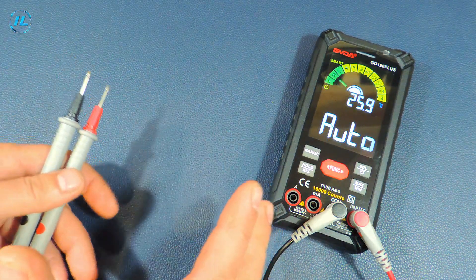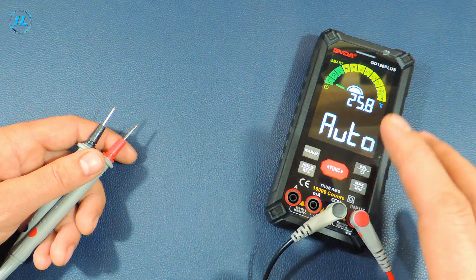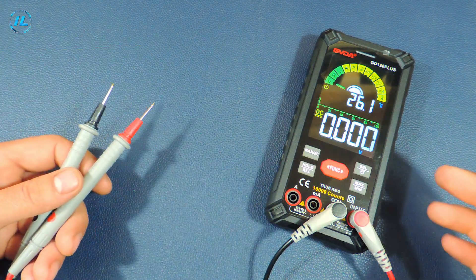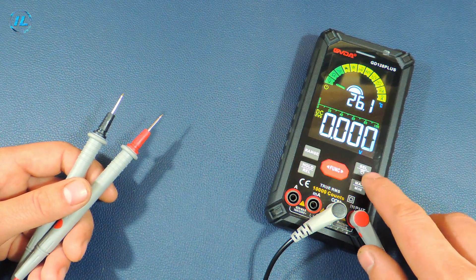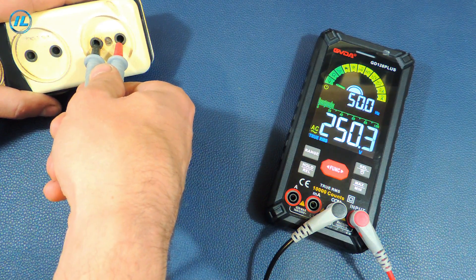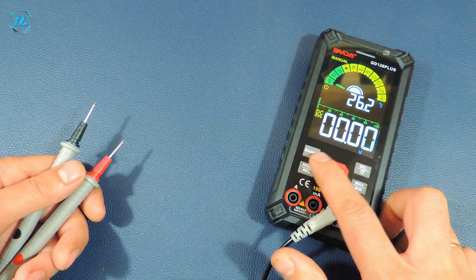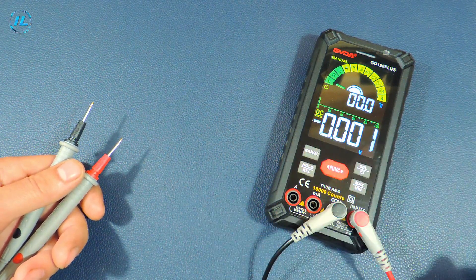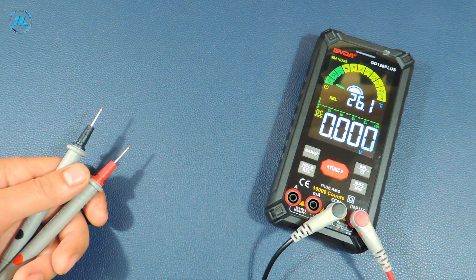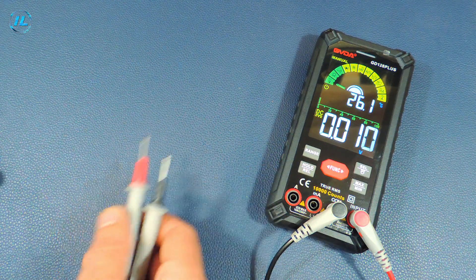As you can see, the multimeter handles automatic mode perfectly without any delays. Using the function button, you can manually select the desired measurement mode. The first mode is voltage measurement. Pressing the SEL button switches to AC voltage measurement mode — 250 volts. Using the range button you can set the measurement range: tens of volts, hundreds of volts, or single-digit units. Pressing and holding the REL button switches to relative value measurement mode. The MAX/MIN button fixes maximum and minimum values, and the HOLD button saves the measurement value on screen.